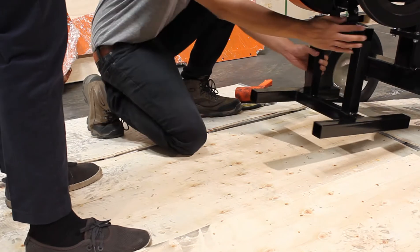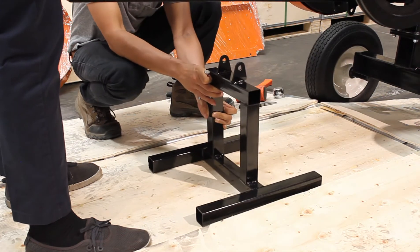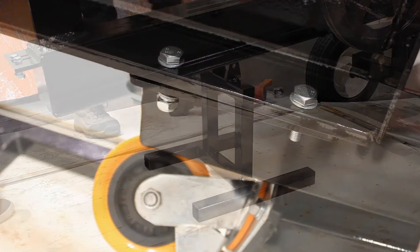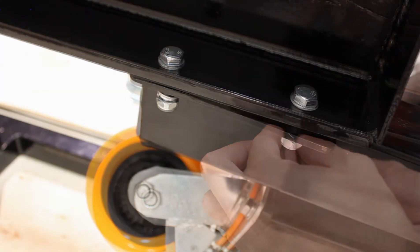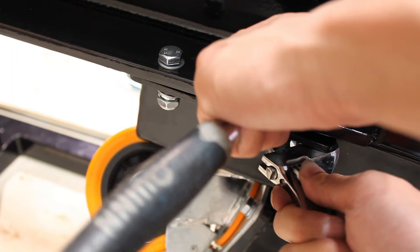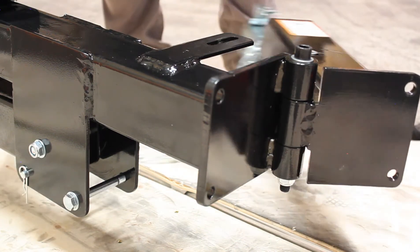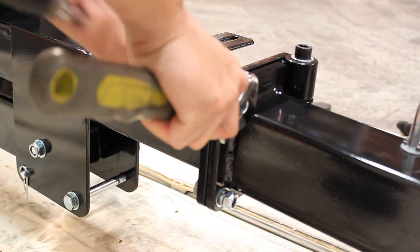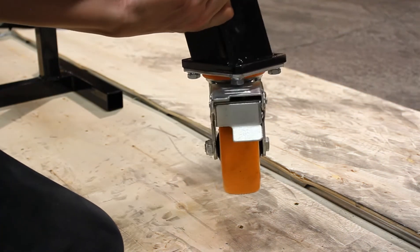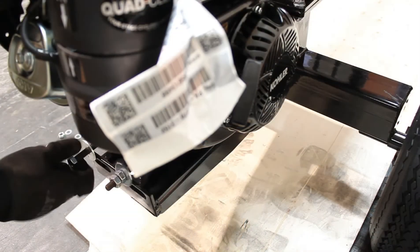Now, with an assistant, you want to lift the front end, remove the pivoting mount, and then move it forward on the I-beam. This will give you the clearance to install the front end. First, you want to install the tow bar mount and tighten it down with a 17mm socket and adjustable wrench. Now open up the tow bar swivel and install the bolts to keep this open in the extended position. Then swivel down the front end wheel so the machine should be standing on its own.